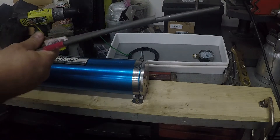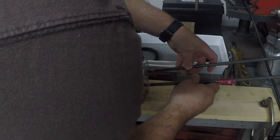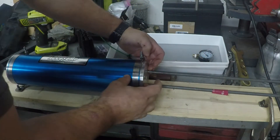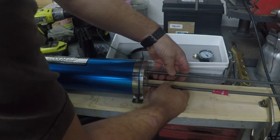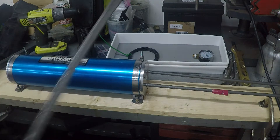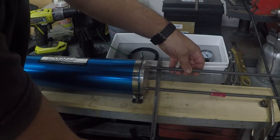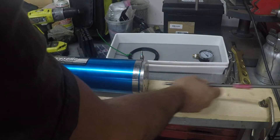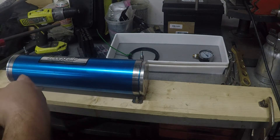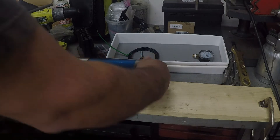Once I made two rods and ground them down until they fit in the holes, I put them in the holes — you can see they fit pretty tight with a lot of engagement. Just make sure they're well seated. Then all I did was take a very long screwdriver, put it between them, and it started to loosen. This side I've already loosened off camera, but the other side I haven't done yet, so when you see me break that one open it'll be the first time.